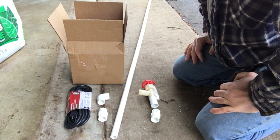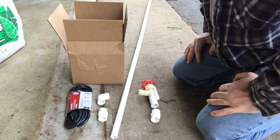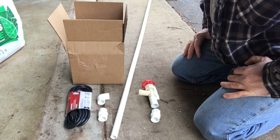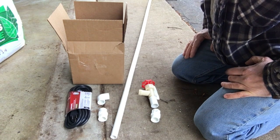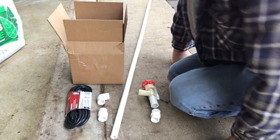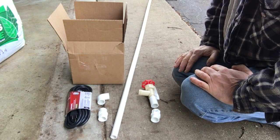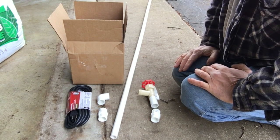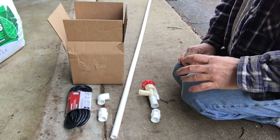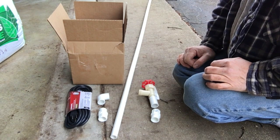I'm working on a water harvesting project and wasn't quite sure what to do about a pump. I have done gravity pressure systems before, and full-on very expensive water pump systems. What I had not done — and what was requested — was to come up with an inexpensive solution: a pump that can pump uphill 15 feet, will shut itself on and off from a garden hose. When you're watering it comes on; when you're not watering it goes off, providing immediate pressure for a mist irrigation system.